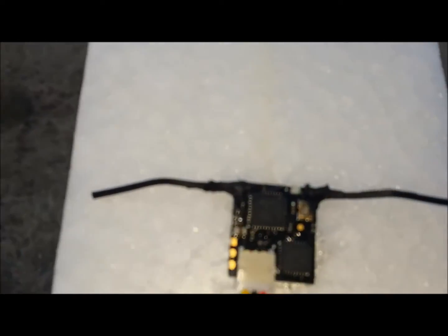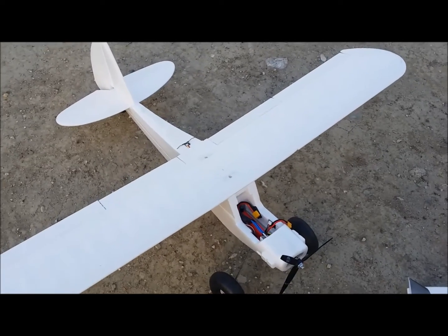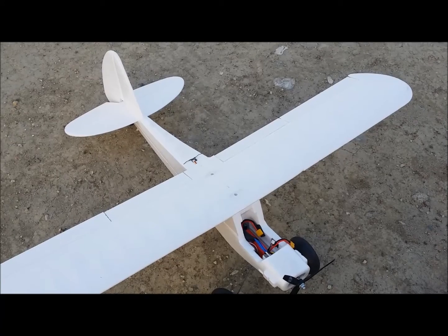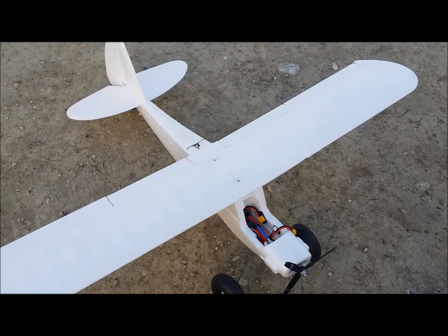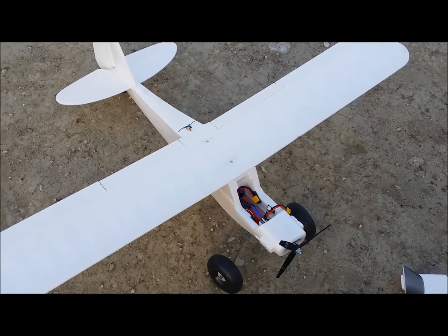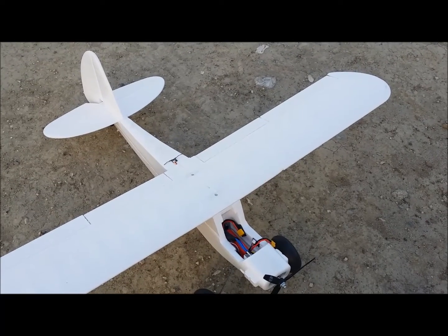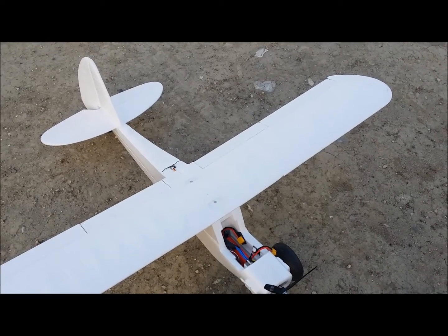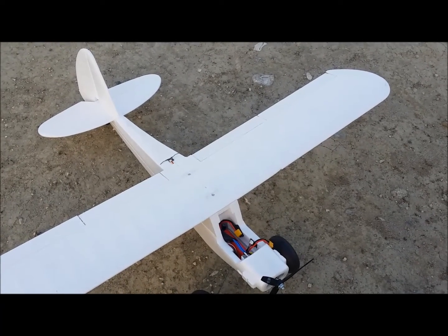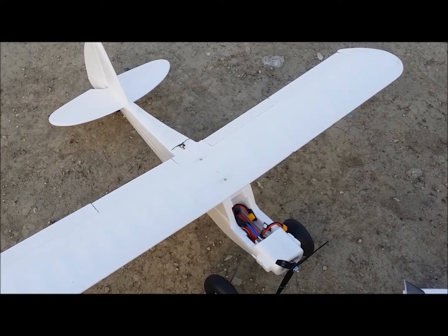As you can see there's some stuff that looks like glue on the antennas. I use insulation coating around the antennas just to give it a little bit more strength. Some people use hot glue. I think out of all the defects for this receiver, the antennas are a little bit weak. They made an adjustment to try and add a little more glue to stabilize them, but the glue they used was CA glue so it was kind of crispy and any movement would just crack the glue. So I use insulation coating around the antennas for both the satellite and the actual receiver.